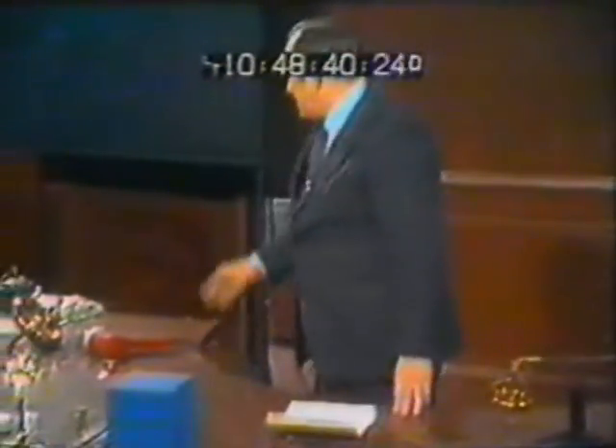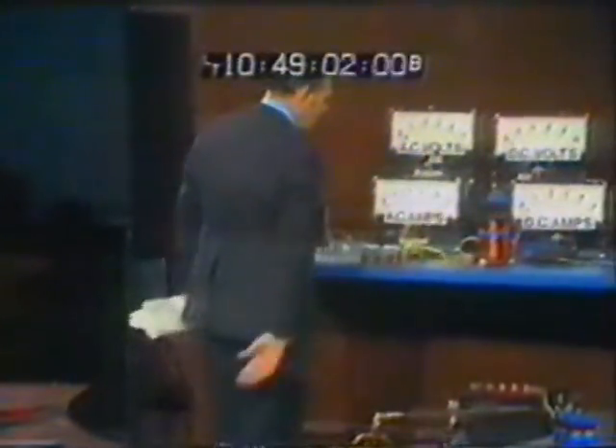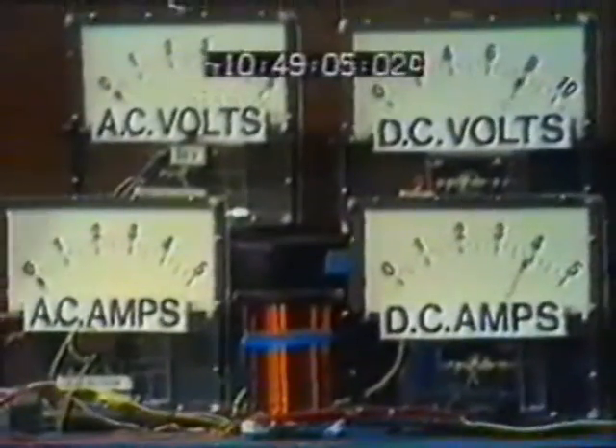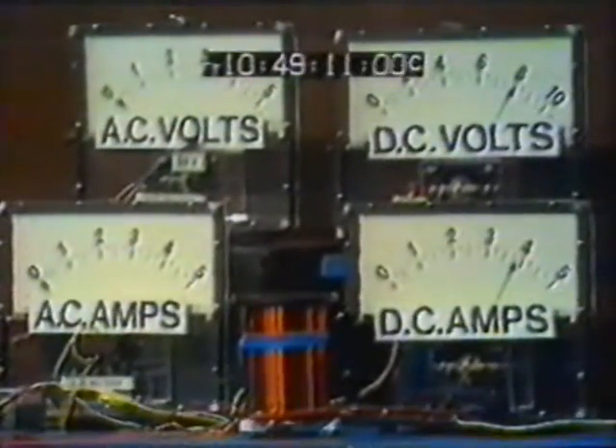I'm going to go back to an electrical experiment. In this theatre, someone said to Mr. Faraday, 'What use is all this?' He was my personal hero — the man who showed that Ohm's law was only alright for DC. I'm using this coil again. You put DC through it from a battery and you get 4 amps and 8 volts. That coil has a property all its own which we call resistance — Ohm's law. With 8 volts and 4 amps, you get 2 ohms.